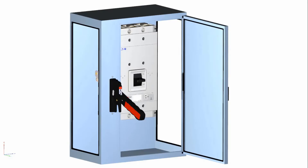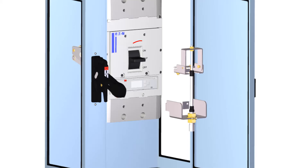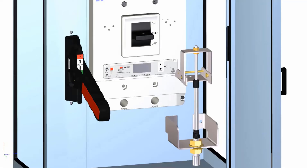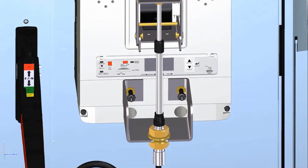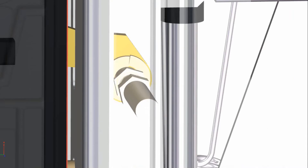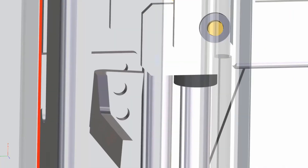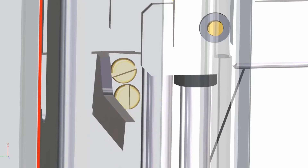Then, to install the actuator mechanism assembly, first remove the bottom two cover screws as shown. Verify that the breaker is in trip position and move the outer handle mechanism into trip position so that the actuator mechanism mounts properly. Mount the actuator mechanism to the breaker by fastening the two mounting screws and lock washers provided as shown. Lastly, fasten the door interlock pin and lock washer into the handle as shown. For the metal handle assembly, the door interlock tab is installed using the two screws provided.